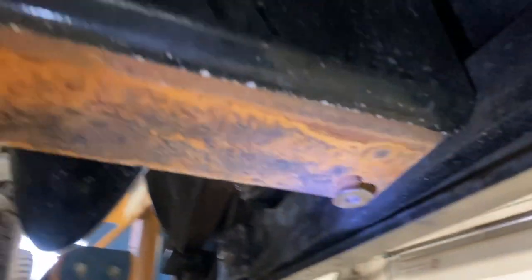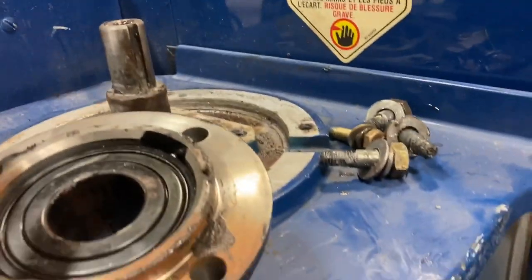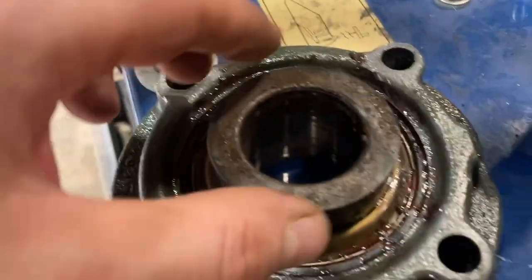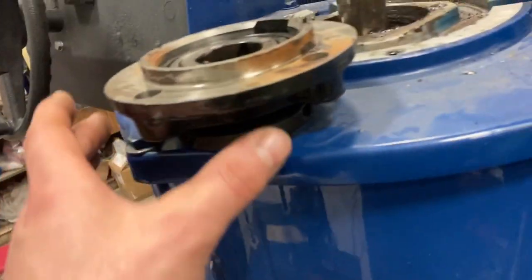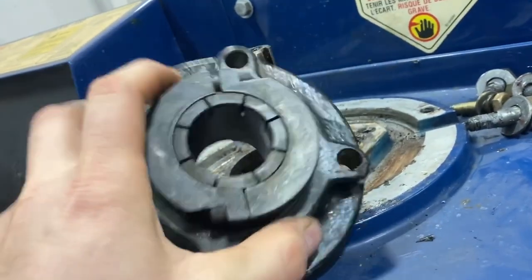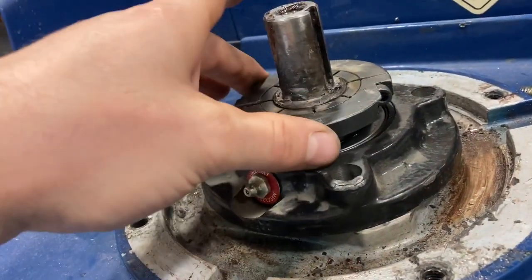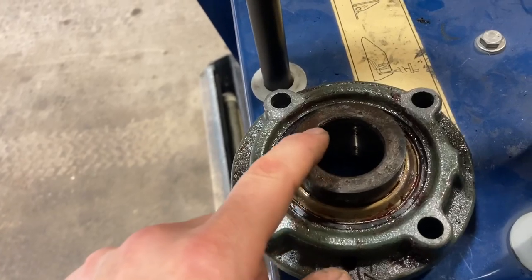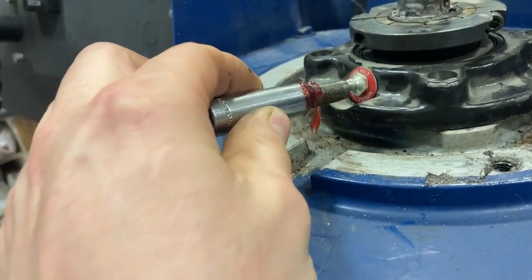This is the top vertical auger bearing. You want to pop your drive motor off — it's just four bolts. Then there's a coupler, a drive that you take out with just a set screw holding it on. Unfortunately this bearing did turn a little bit on the shaft, even though it's still in good condition. These are tough to sub out — you're probably going to have to get them from your dealer. I was able to get a replacement bearing with a different collar that will lock better. This locking collar, being able to squeeze, will hold onto the shaft better than just a single set screw. They say about every two seasons change these out. You'll have to pull the little grease extension out of the zerk before you can pull the hydraulic motor and drive housing off.